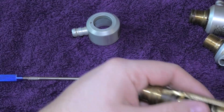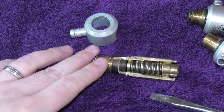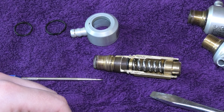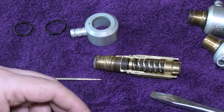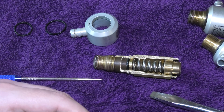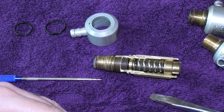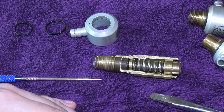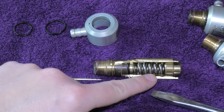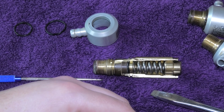It's a very simple device and they are quite well worth fitting to most washers. Obviously if you've got a 250 bar pump, you can fit one of these — it'll give a good indication. If you've got a blocked nozzle or something causing a blockage, that's going to give you increased pressure. So rather than straining your pump, if you've only got a 250 bar pump, you could be over-pressurizing the system — putting out 260, 270 without realizing it. This would kick in and you would know straight away on the lance; it would just cut out immediately in your hand.